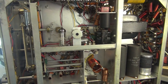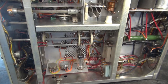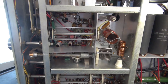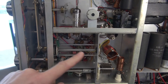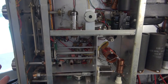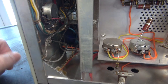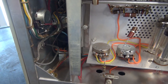Here's the bottom side of the Apache. The challenge is: where do I locate the push-to-talk module? In a Viking 1 and 2, the plate switch is down here and this whole area is open, so I can simply glue it to the chassis and route the wires. But in this case, the plate switch is buried way up there — it would be impossible to get a hold of those terminals.